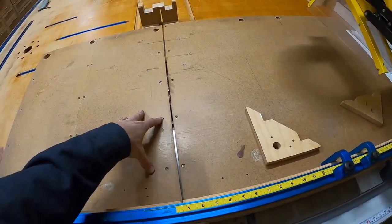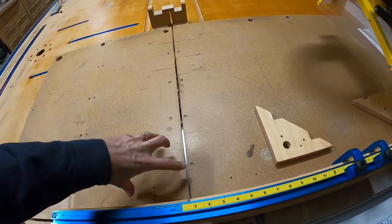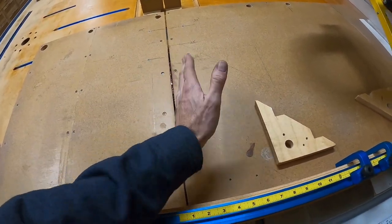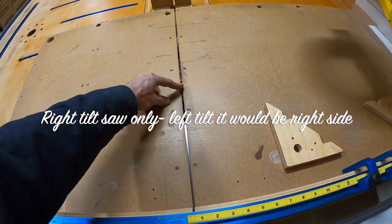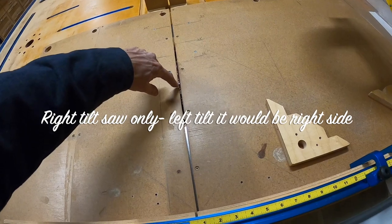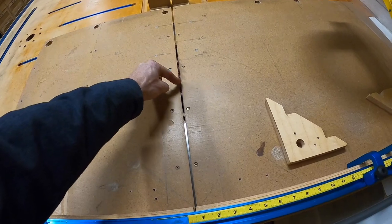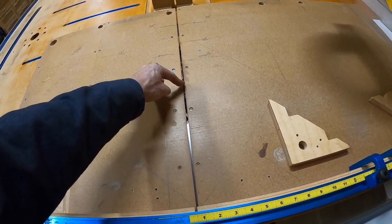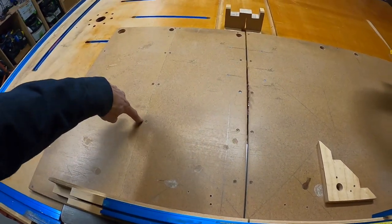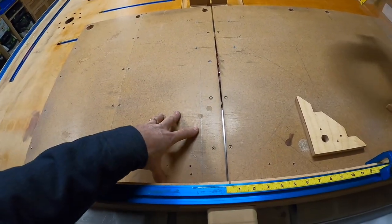Although this has the removable insert, I actually did it just on one side. I felt like the right side is always a constant — it pretty much never changes. It's the left side that does. So if you go from a thin kerf, it shrinks on the left, stays on the right. So I figured, who cares about the right side? I'll only change the left. I actually have a split piece here that allows me to just change this section.